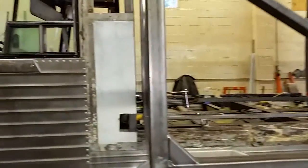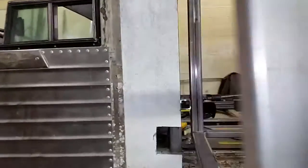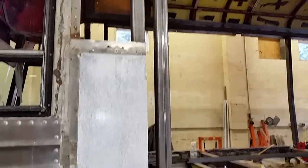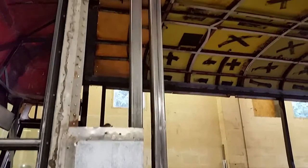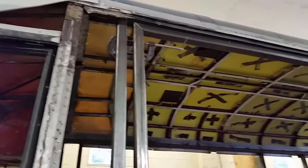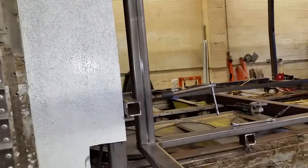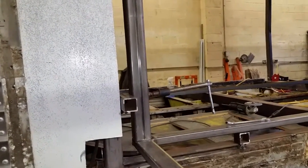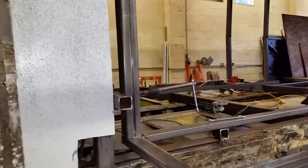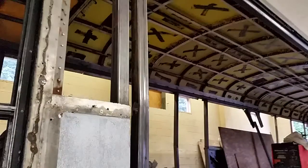The way I'm keeping this gap where I want it — I've got the inner wall tubing in place now, as well as the upper one. I've just used inch-and-a-half tubing as a spacer and got it clamped in place, then I'll tack-weld it all in. I'm going to put a diagonal brace in there temporarily.